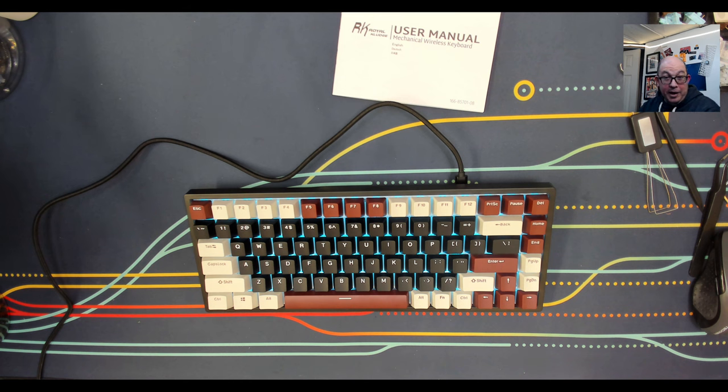I'm definitely going to come back to it and get the best sound out of it, but they've already kind of taken some of the work out of my hands because they have put in plate dampening. I probably will replace the case dampening and either lube. Yeah, I'll probably just lube the switches and change the inside, as well as Tempest tape and PE foam on. Yeah, I may try something different. There's a couple of ideas I've gotten, but I know that those will make this sound nice and poppy. It'll give it a good tone because it has a nice body.